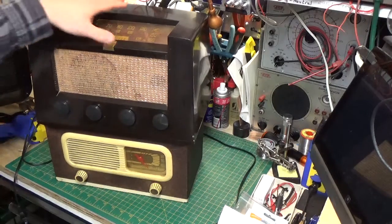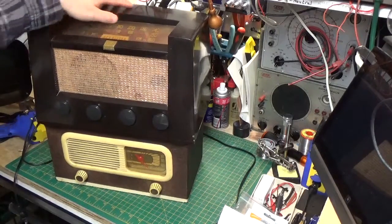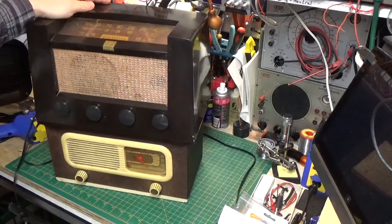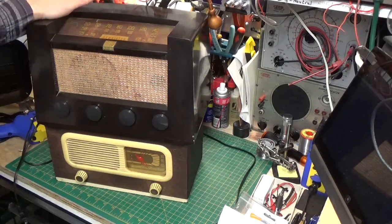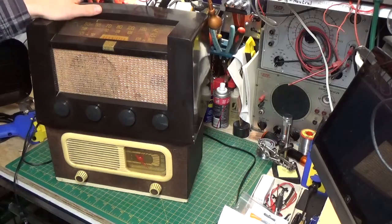This one here, I have a ton of video that I shot. I don't know if I'm going to post it or not. I fought with this thing on the FM for the discriminator circuit and so forth to get it to balance — never did get it right. It came in, it works. AM is perfect. FM is still kind of noisy, a little bit of distortion. And I think there may be a problem with one of the IF transformers, which may eventually need to be fixed.